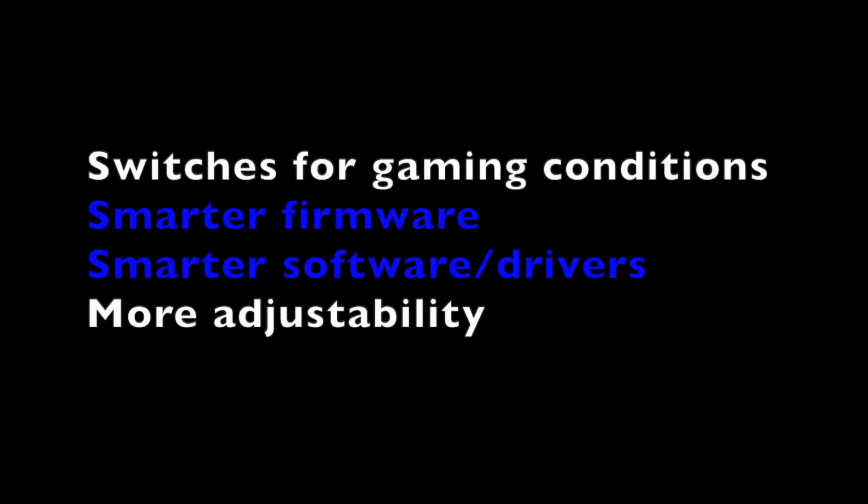I mean, if you're having hardware problems, you can adjust a whole lot in your firmware, and while I do think they should fix the hardware problems anyway, there's no reason you can't rewrite your debounce routine to compensate for it a little bit and to compensate for the aging of the switch. So when they're nice and fresh and new, you can have a lower time, and when they're getting older, you can extend that debounce time a little bit more.